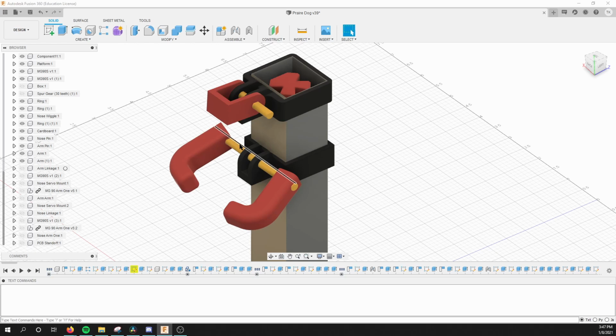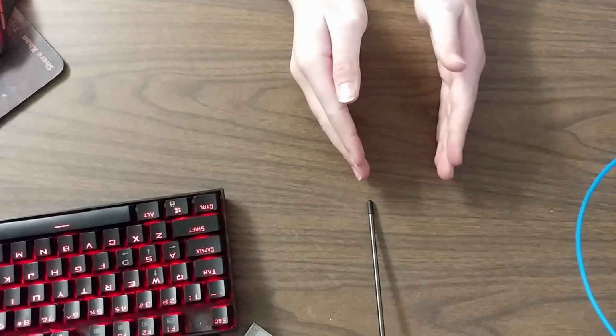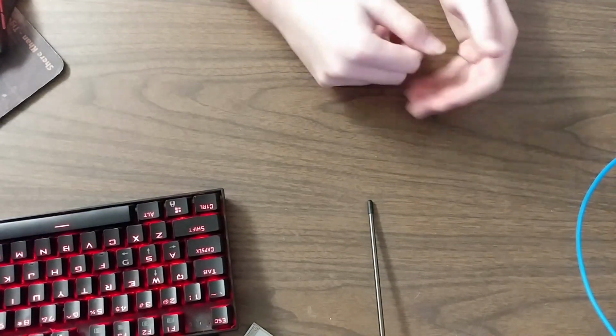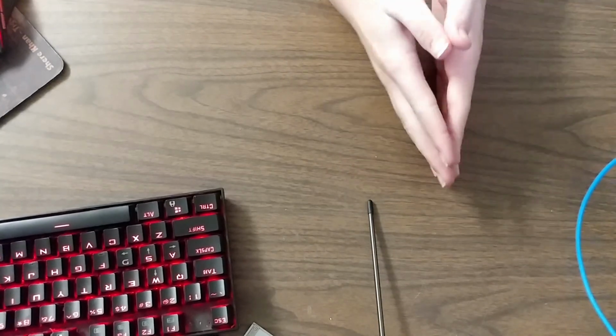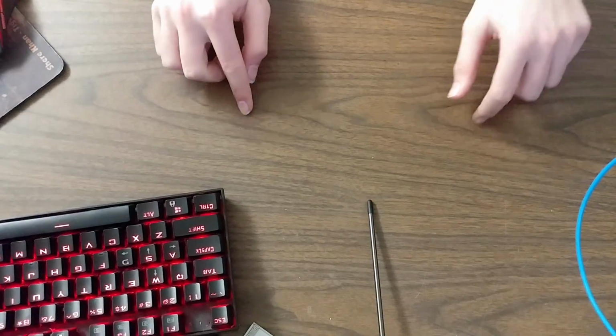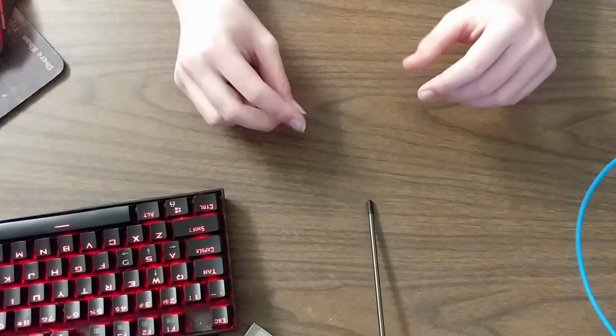The hardest part about getting the nose mechanism right was trying to find the right distance from the cardboard tube for the nose mechanism to stick out. If it was too short, the plastic bit didn't actually touch his skin, and it didn't look like he was actually wiggling his nose. But if it was too long, it stretched out his entire head, made it really narrow, and left big prints, and you could see all the mechanisms through the skin. So that's no good.